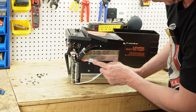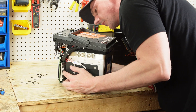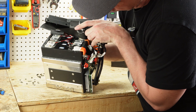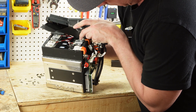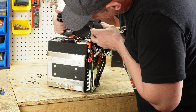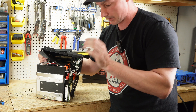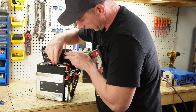Right here you can see the connection for the heat pad that's on the bottom. We have a heat sink for the BMS on the back that comes out the other side. We have our balance lead cables. The temperature sensors are glued to the top of the bus bar on the positive — and there's another temperature sensor over here on the negative terminal. So they have a temperature sensor on both the positive and negative terminal, which is the best place, because you're getting the direct temperature of the actual cell internally. That is very smart.